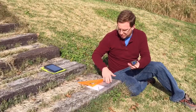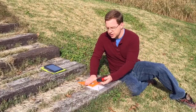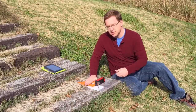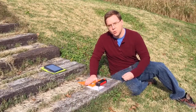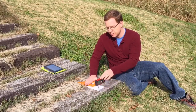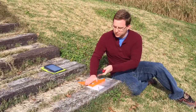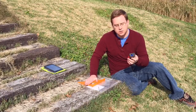I have set up here my flat surface and my compass. By holding the square down like this, I now have an almost 90-degree edge which I can use to brace my Disto. By turning it and pressing it up against the square, every time it will be pointing in the same direction. I don't have to worry about aiming because I'm using the case of the Disto to aim the device for me. I go through all of the procedures using every single shot, and I'm extremely careful to hold pressure because I want the first 14 sets of shots to be extremely good.